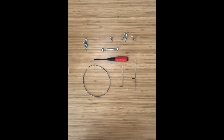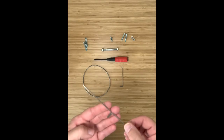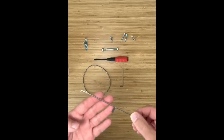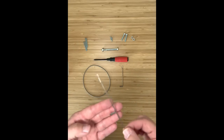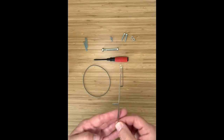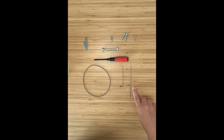And lastly, and possibly most importantly, you're going to need some needles for your sock machine. The needles that I've purchased are the Brother Ribber needles, KR850. And they look like this when they arrived. This is used for a horizontal knitting machine that would knit back and forth. And so in order to make these useful for my circular sock machine, I have to cut down the bottom leg so that it looks like this.